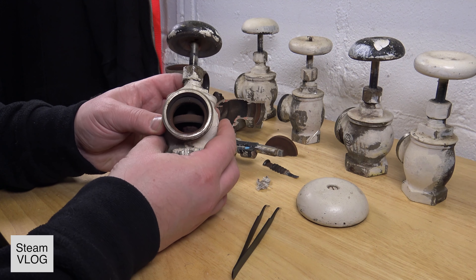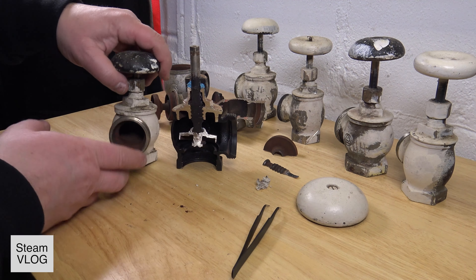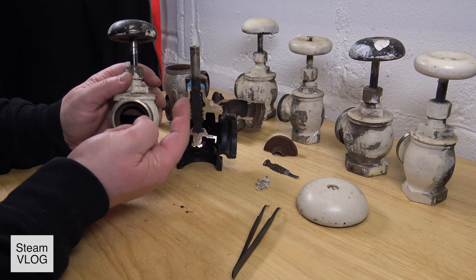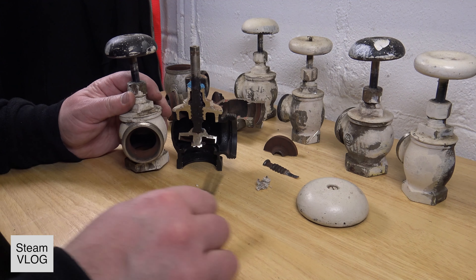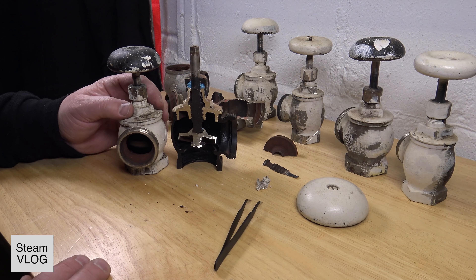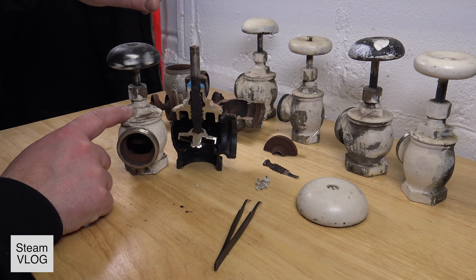You can take a look inside — when you close it, it's completely closed, meaning this piece is all the way down, and when you open it all the way up, it's all the way against the ceiling. The packing here, the blue material, is probably blown out so it can leak — it leaks especially when you have the valve only a quarter or half open, which you should never do on steam heat. But if you have a heating system where water goes through and you have it half closed, then it leaks a lot of water.